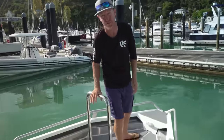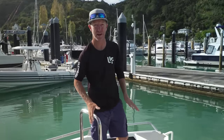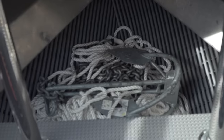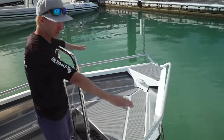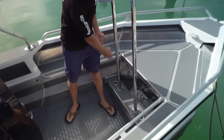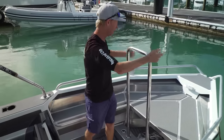This is the first addition I've added to the boat, starting from pretty much a standard boat. I've had this bar fabricated up that lifts in and out. It works as an incredibly great casting rail - I'll cover this in more detail in the fishing setup. Plenty of room underneath the casting platform. I've got 100 metres of warp, chain and anchor that goes out over the front. We've brought the bow rail around nice and low, running the anchor straight down onto a roller at the front and a cleat. And we've got this rod rack up here which is also a step to get onto the casting platform.